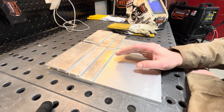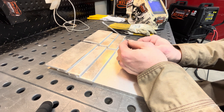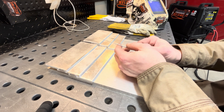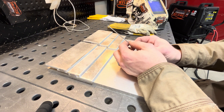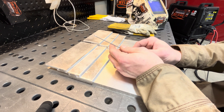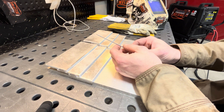If you've seen my video on the large water-to-air intercooler I built a few weeks ago, there's a lot of welding on that — probably six hours of actual weld time. I could almost weld that whole thing with one 3/32 tungsten ball as long as I don't contaminate it. With a sharpened or blunted tungsten it seems like I'm constantly having to re-prep it, which I find really annoying.